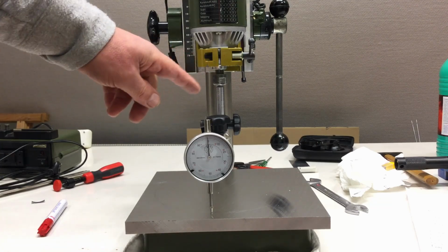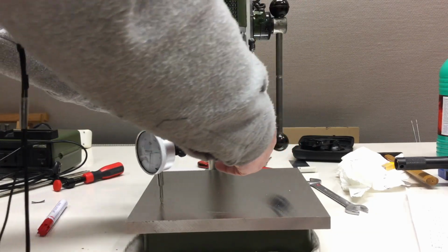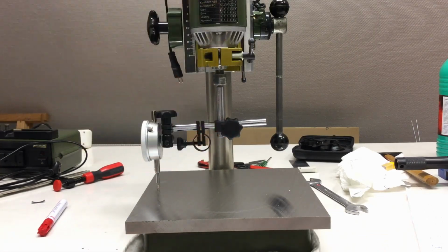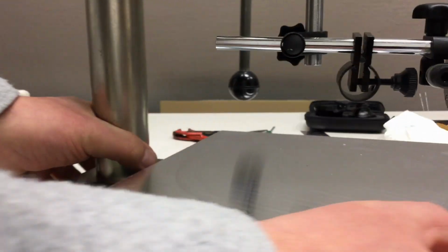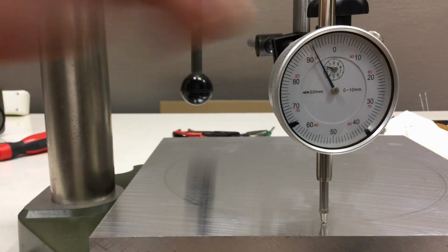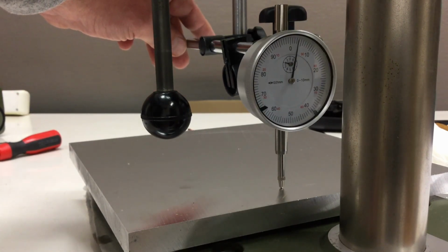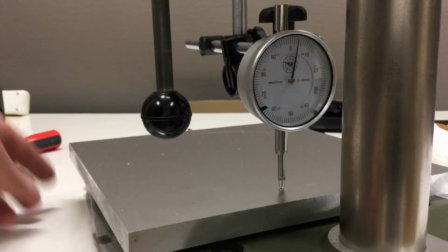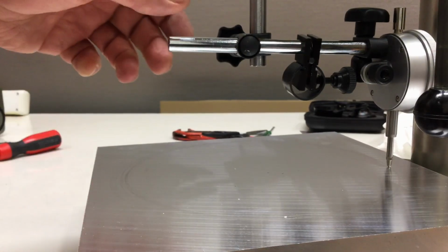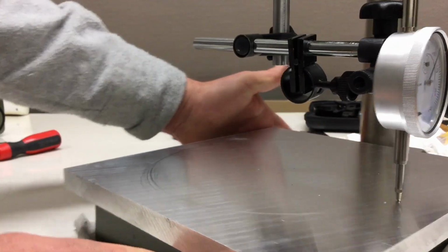And just as a sanity check, the spindle is locked now. And I'm turning my whole assembly here 45 degrees. And then we do the whole measurement again. So front 0. On the left we got, oh, -8, not too shabby. And at the back we are at +4. +4. Can you read that? It's +4. And at the right, yeah, +12. And hopefully at the front, back to 0 again.